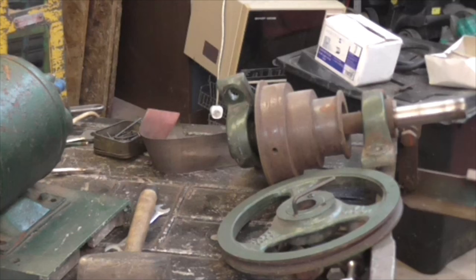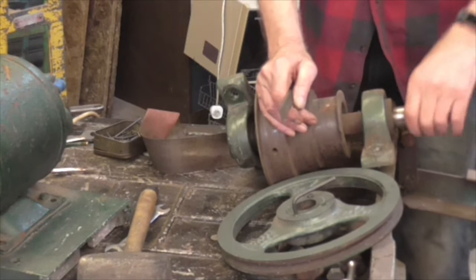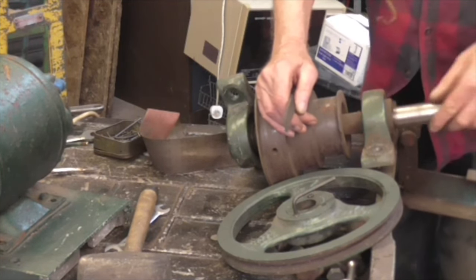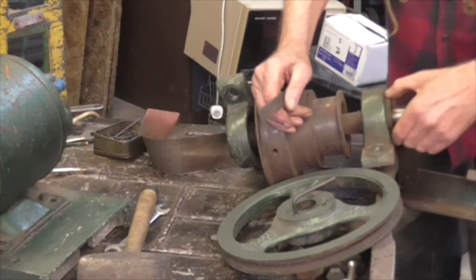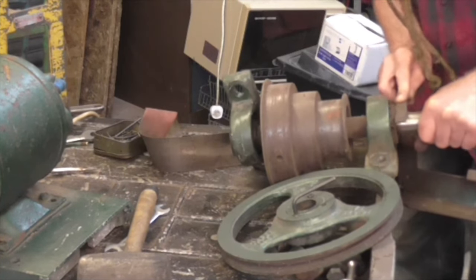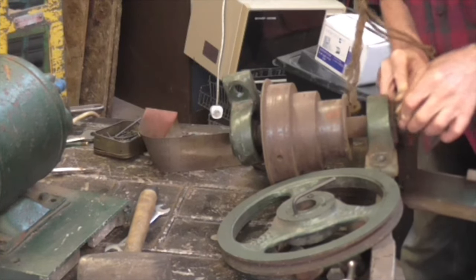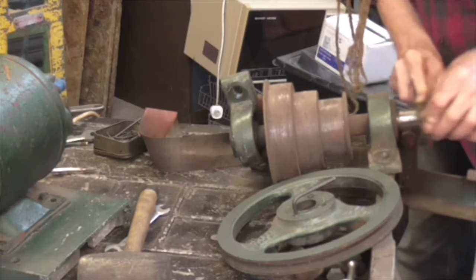Morning folks — Tuesday, and I'm back on this again. When you're doing something like this — I know it's obvious — before you start trying anything, clean all the shaft off, emery tape it off, get all the little lumps out. I've got this ring loose but I noticed when I first touched it that it was partially loose and had been spinning, leaving a ridge all the way around. Going to take the ridge off with a file and see if it will come up.